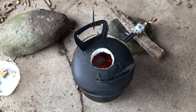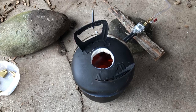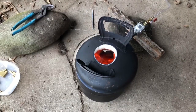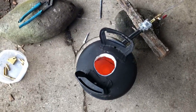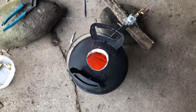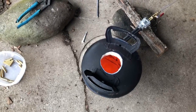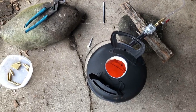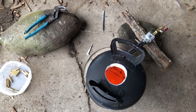I just want to get the brass hotter than the melting point so it's very fluid and pours easily. I don't have a tool close at hand to get the dross out, so we'll see how it goes. We'll heat it for a few more minutes. I was able to use that steel bolt that had stowed away in our scrap brass with channel locks to get a bunch of the dross out — so the steel bolt made itself useful. We're going to pour in about three or four minutes.